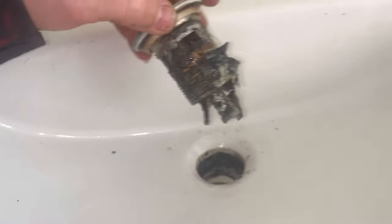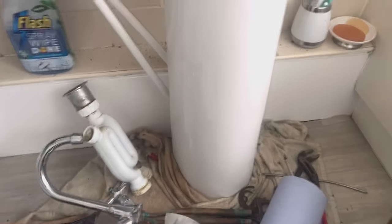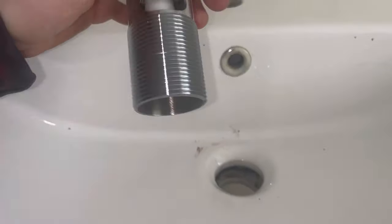We did manage to get a hand down the back side - camera angle's rubbish - but that waste is disconnected now, which is lovely. Trap's out, waste out. My favorite substance right there - silicone. The previous person siliconed the waste in, which is the wrong way but I hate silicone - it's going to be a pain now trying to scrape all that off.